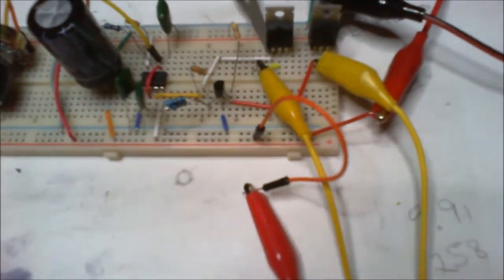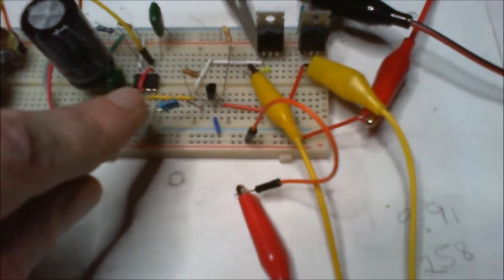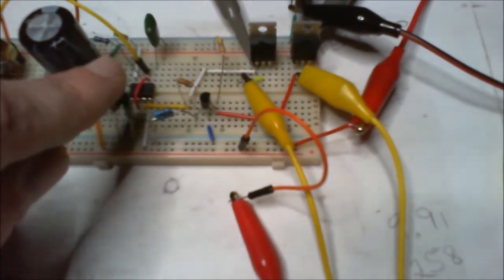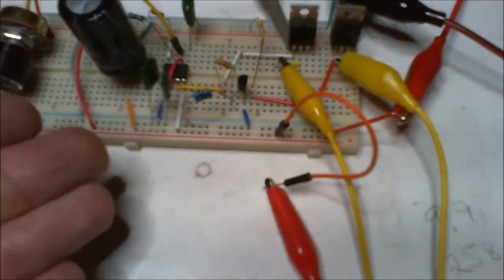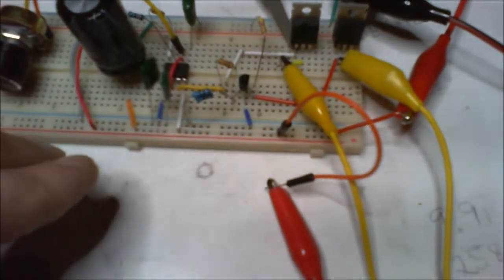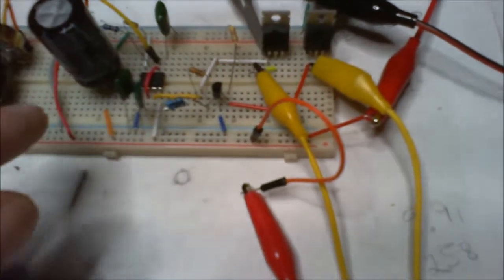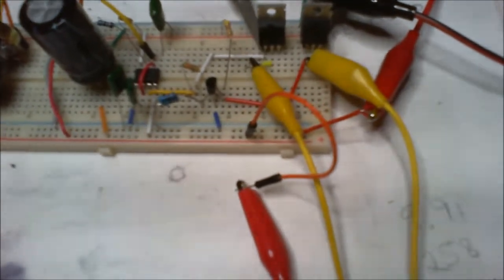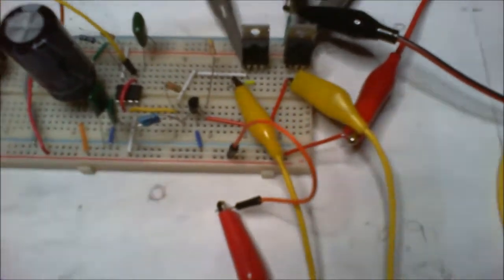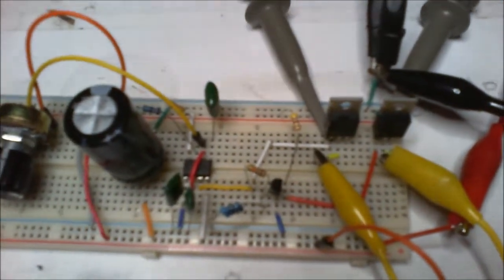As far as what I understand works, I've got to use this 80 nanofarads here. There's a 47 and a 33, because I couldn't get the frequency down, because it kept sitting at sort of 60-64, trying to get it down to 50 hertz, and a range between 50 and 60 hertz is fine. But it works, and I hope that you've managed to see everything, and that I wasn't poking the camera up at the sky or something.